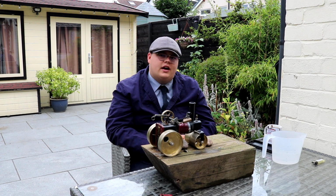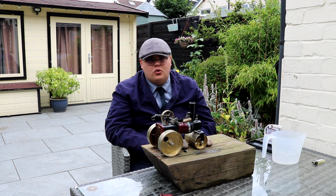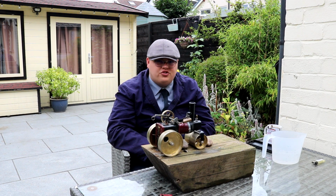In Newcomen's design, after the power stroke, there was a spray of water. Watt decided that if he removed the steam to a different cylinder after it had been sprayed, it would cause the steam to condense more quickly. Therefore, the engine would run faster and more efficiently.